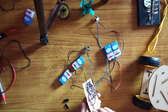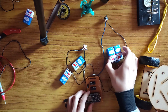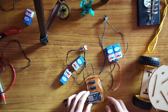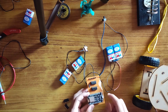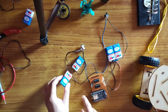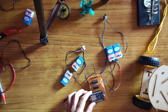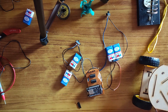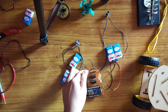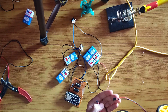Now we have completed the circuit and I have also connected the power supply here. These two batteries are connected in series and they are used to power up these ICs and this NodeMCU module. Now these two 9V batteries are connected to each of the two L293D drivers to power up these motors. I have connected these female strips to the wires so that I can connect them to the male pins here.